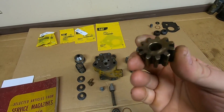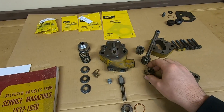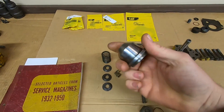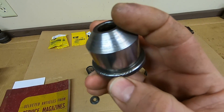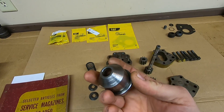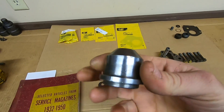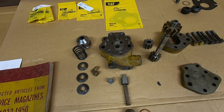Remembering back to when I took this apart, I made note of those punch marks on the drive gear and I think I've pieced together how they got there. The last person that put this pump together was obviously fighting the spring tension exerted on the outer seal retainer. Looking at the jaw tooth marks around the outer lower rim of this piece, I believe they clamped it in a vise — barely hooking the bottom edge of that shoulder — and cranked it down long enough to use a hammer and punch to drive that gear onto the shaft.